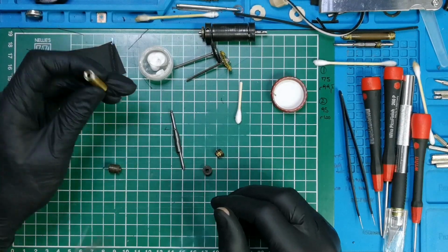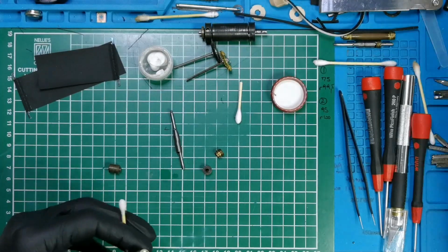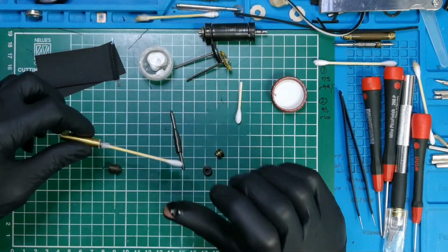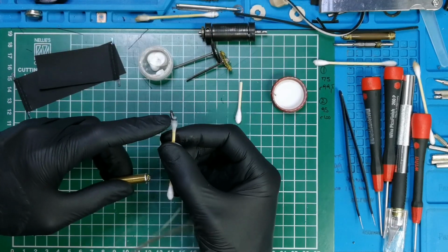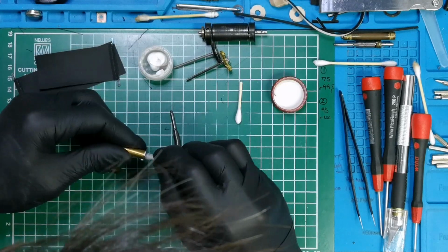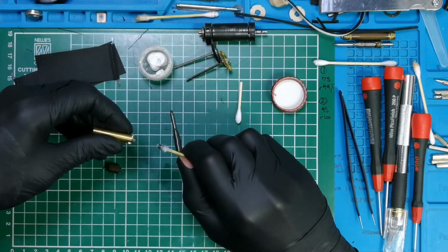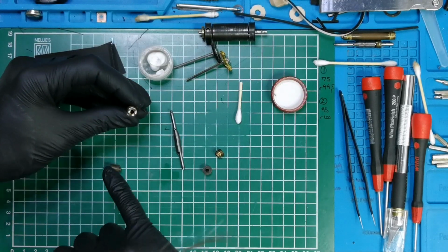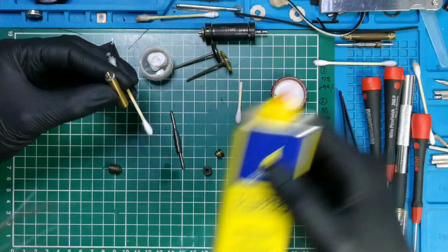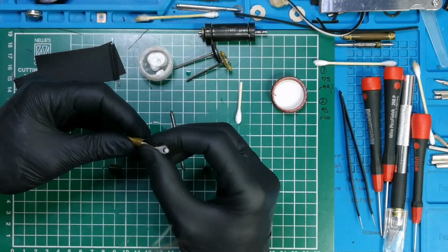And you will feel it getting very, very warm or hot, depending on how much you insist. And then I use another Q-tip in naphtha or alcohol, doesn't matter, to actually clean the inside. And you'll see this dark metal mark on the actual tip. Is it Q-tip or earbud? Earbud. And the entire area that was in contact with the rotating bit is now super shiny. Okay, that's one.